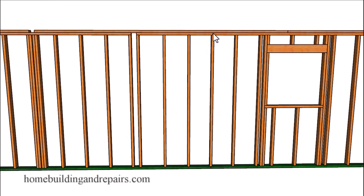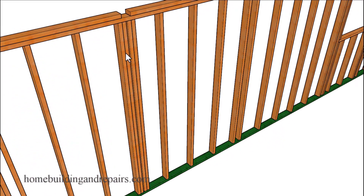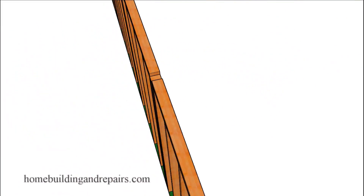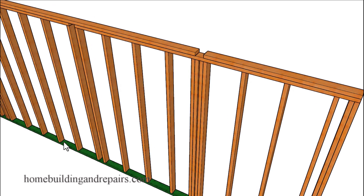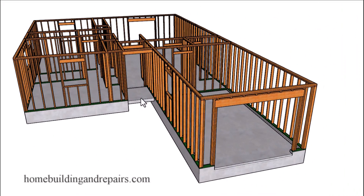This is a good example of our framing breaks — we have a four foot minimum, and then a long 2x4 connecting these two walls together, which is common practice when dealing with two intersecting walls. If I have two walls on each side I can install flat backing, two by fours like this, or even some blocks to save a few dollars. When using 3D modeling I can fix a lot of this, but that might not be the case when working on a project and trying to figure out what it's going to look like before you can see it.